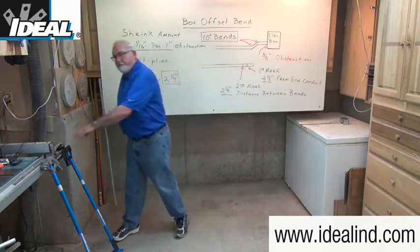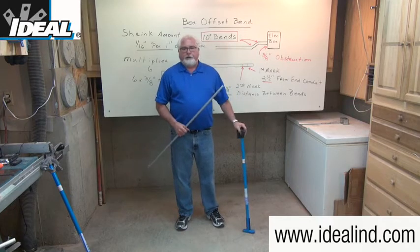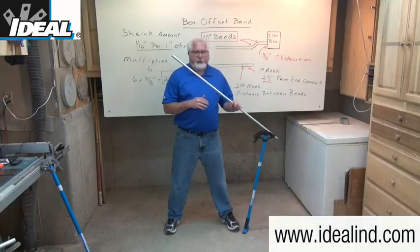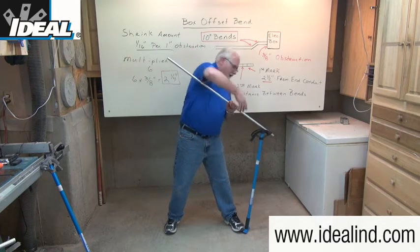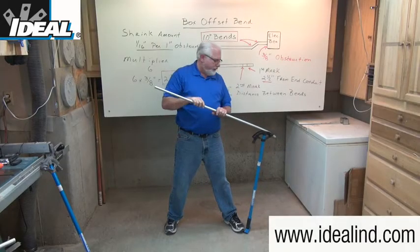Offset bends are done in the air, not on the ground. Take your conduit bender, point the handle down with the head closer to you, then step two is to insert the conduit into the bender head and line up that first mark with the arrow on the side of the bender. Bend your knees slightly, lower your center of gravity, place one foot against the bender boot so it doesn't slide, tilt the bender slightly away, and using constant pressure bend that first bend to 10 degrees — the bottom of the conduit will be even with the 10-degree mark on the bender head.